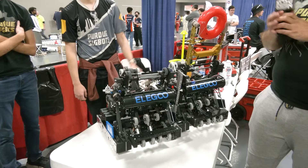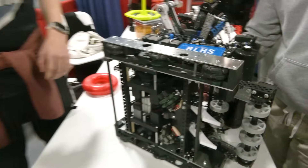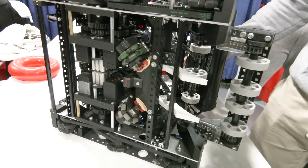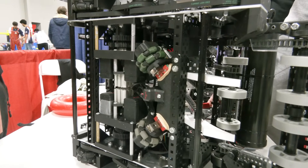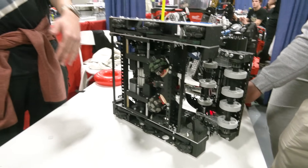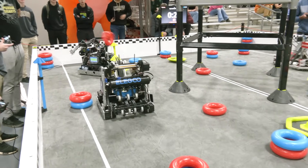Let's talk about software. The odometry pods are angled at 45 degrees. The reason we chose two instead of three is space limitations — we had lateral space but weren't comfortable fitting three odometry wheels vertically with the intake motors. With two pods, the best orientation is 45 degrees. On a tank drive with standard forward and horizontal tracking, you typically only have one wheel tracking most of your motion — the other is almost never used except on arc turns. At 45 degrees, you're averaging two sensors for almost all straight movements, improving accuracy and consistency while decreasing noise, leading to significant improvement in consistency.